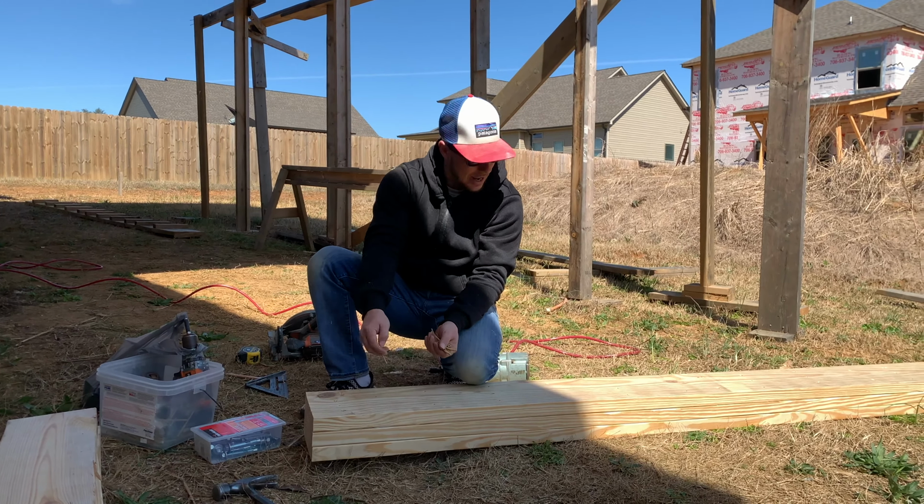We got the header under here. We're gonna have to work it above this plumbing pipe right here, the drain pipe. And we've got 2 stiff legs cut, one for the tool man's side and one for my side. We're gonna lift this baby up under there. We're gonna put these stiff legs under here and wedge them in there so that we can get it in perfect alignment and put some screws up here and hold it into the floor joist temporarily while we're setting our jack post. Put a little light tack here in my stiff leg.